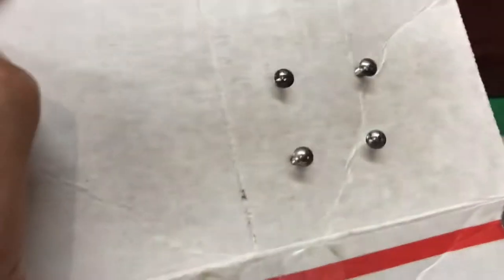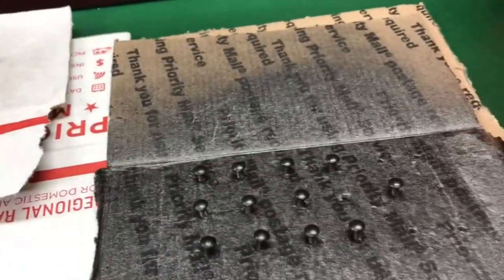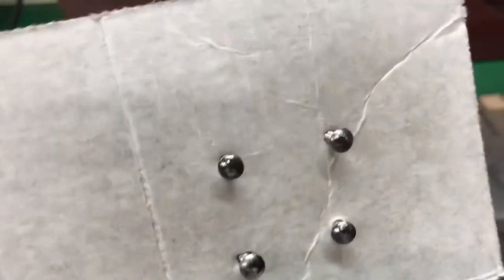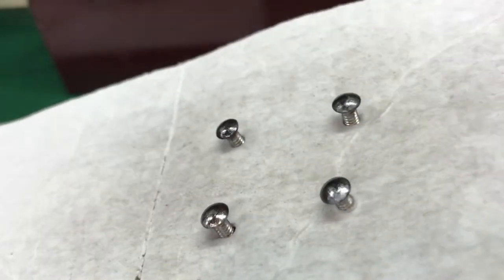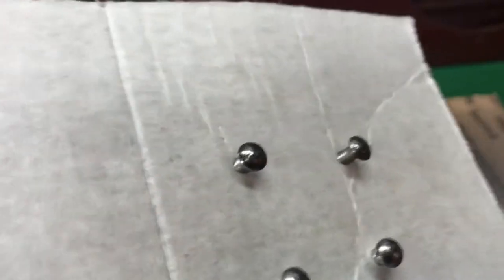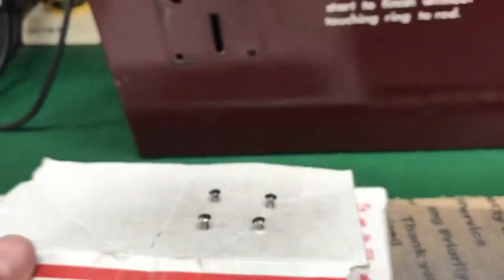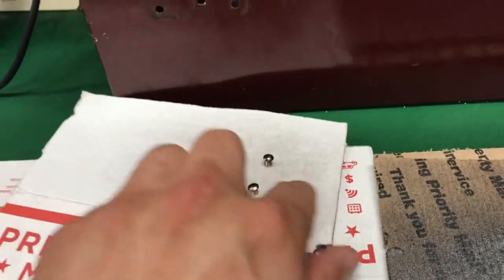For the ones on the plate here, they're all supposed to be nickel plated. Of course, to find a small 6-32 carriage bolt like this is going to be impossible. Since I'm not restoring it, I'm not going to start ordering hardware online. So I cleaned them off with the wire wheel and Dremel again, then buffed them with a buffing wheel and chrome polish, soaked them in alcohol to clean them, put them in my ultrasonic cleaner in a little beaker, wiped them clean, and hit them with just a shot of clear coat so they'll stay shiny.